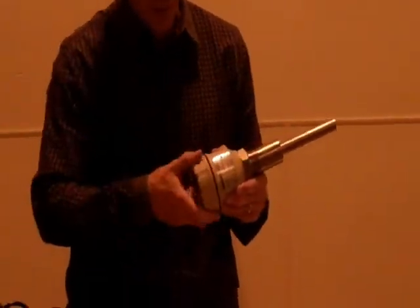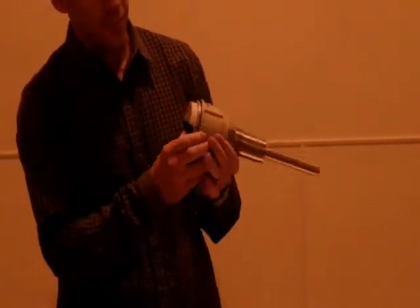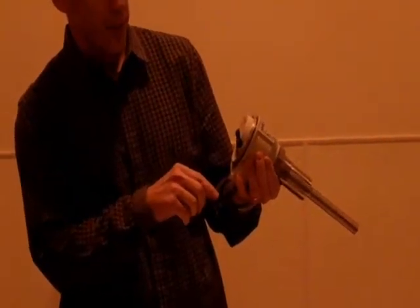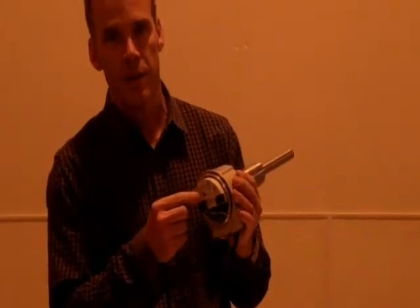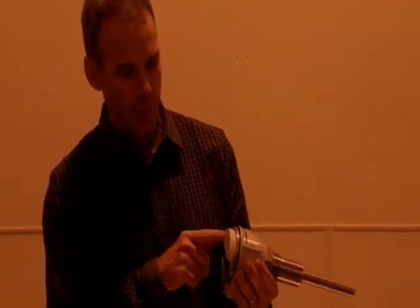Screw-off cover. There is no calibration — this is completely solid state. We just stick it in and you're ready to run. It has normally open and normally closed contacts. For sensitivity, you have a high and a low density setting. Anything above two pounds per cubic foot is a good application for the vibrarod.